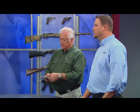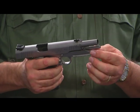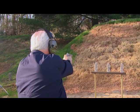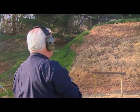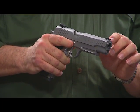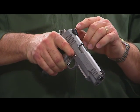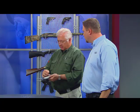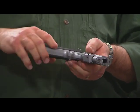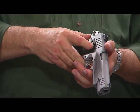It's not something that John Browning thought of in his day. Another feature not on the original design is the full length guide rod. I'm not a big fan of full length guide rods, but a lot of people like them because they add spring life — they allow the recoil spring to eliminate kinking, so the gun increases its endurance and lasts longer. We see that it has a dovetail installed front sight, and a trinity of three white dots: a single dot on the front and two white dots on the back of the U-notch on the Novak rear sight. Moving to the side of the gun, the trigger is adjustable for creep, and the front of the frame is serrated for increased purchase by the shooter.